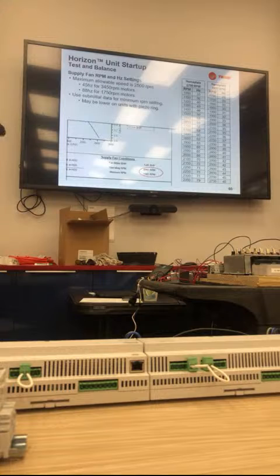Technically, the 1750 RPM motor can go to 120 hertz. They have the same bearings as the 3450, so they're built the same, just the poles are different. So you can technically take that up to 120 hertz if you don't overamp. So 100 hertz is not unheard of. We shouldn't be running there unless there's an issue of airflow, restriction of ductwork. It's not designed for that, but it can handle it.